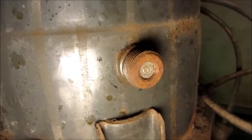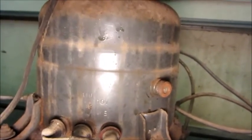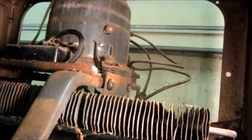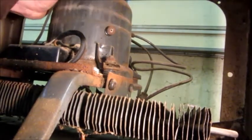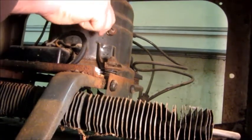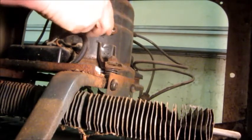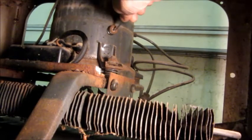Underneath here there's still a plug in there — looks like a lead warranty seal in the service port. I'll get that out and then be able to hook up and put some pressure in the system to push any debris out while I'm cleaning it up. I'm going to try to drill out this plug — as you can see the lead is very, very soft and easy to get out of there. I'll come in with a pick tool. I believe a Bristol key is required to take the plug out once the lead piece is out.